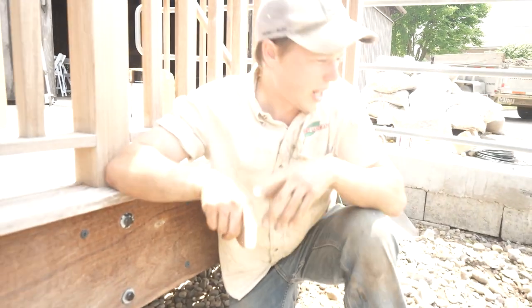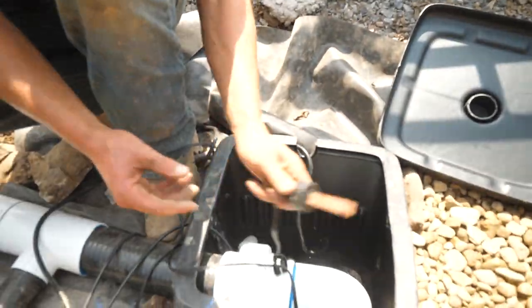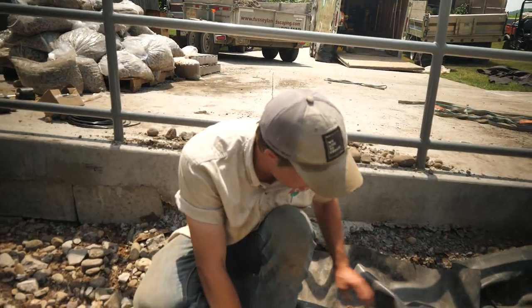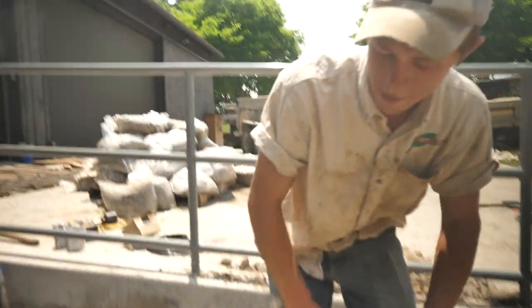It's a copper probe that electricity passes through and it slowly diffuses copper into the water. And string algae, it'll kill string algae. Small amounts of electricity pass through here and these will slowly dissolve into the water and make sure that you don't have string algae growing in your feature. So, no string algae, and crystal clear water because of the beneficial bacteria. So that's what I was doing.